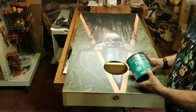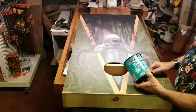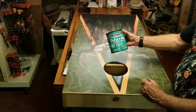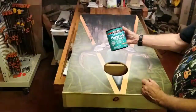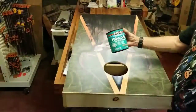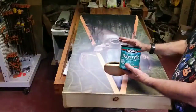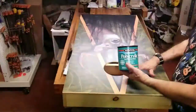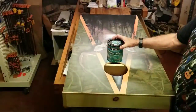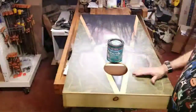In order to protect our surface from scratching and the elements — you never know if you're going to be around moisture — get some Minwax polycrylic water-based finish. It's a clear finish, so it will dry clear. You cannot apply that with a roller — that will leave bubbles. So you'll want to brush this on. You can give it one coat. As long as you don't plan to have these out in the rain, it's a good protective surface.